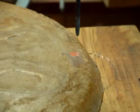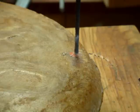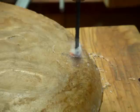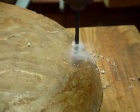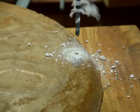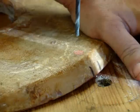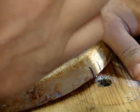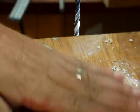Means I can turn this on. Slowly, with very little pressure, come down. Once it's started, then you can give a little bit more pressure — I'm only using like one finger on this to bring it down. Let it go slow. So that's the second one. I'm using a much smaller drill bit. And the last one — I've already lined this up off camera. And that one's done. This bit's a little smaller, meant to help guide the big bit.